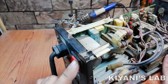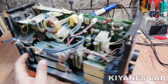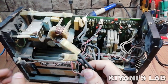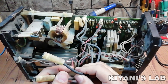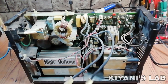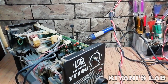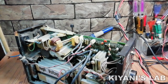The first thing I found is the main switch is out of order — we'll replace it. The second thing I found is the potentiometer is broken — I will change it too. I have removed the wires from the power switch and I'm going to connect the wires in series with a 100 watt lamp. I've connected the wires and there is no output. Let's see if there is any burnt component or trace.